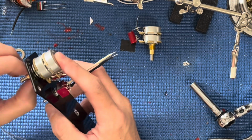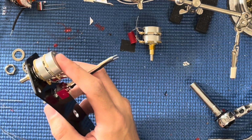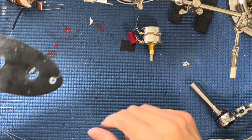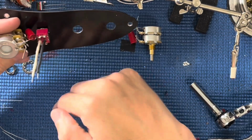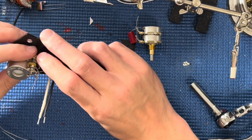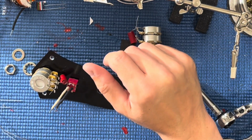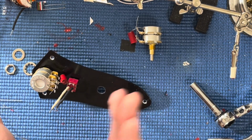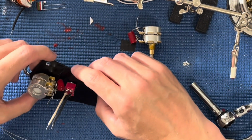You realize how cool that is? I can cut the lows, up to like 30 hertz or whatever, get rid of that mud, and then high end that I don't need. Well, I do that all on the tone knob anyway, but if you wanted to cut the high end, you could. There's a boost switch on it. I was running on the bridge pickup most of the night, and I cut the lows a little bit, and had the parametric EQ right on 80 and boosted that up like 3 dB, so it gave that bridge pickup some beef. It was really cool, man.